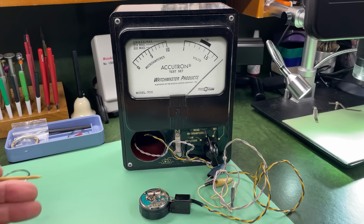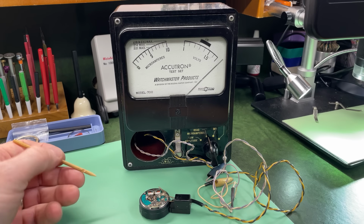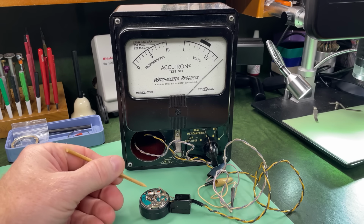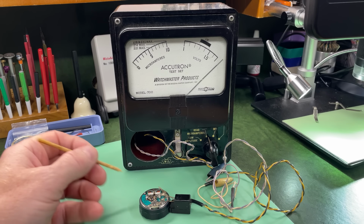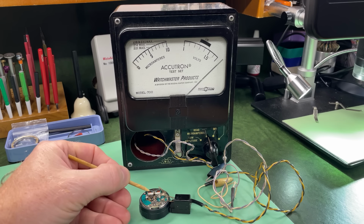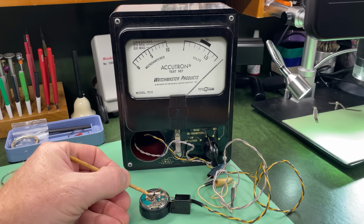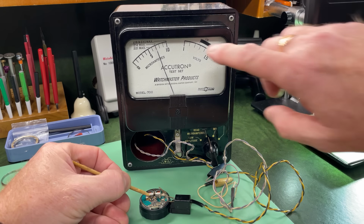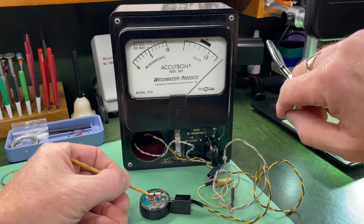So a bit further on now, I've adjusted the fingers and finally got it somewhere near. I've had to fit this thing called a hacking pin because obviously this movement hacks. And if I push that in, I'll be a bit careful here because I'm at arm's length. You hopefully can now passively read that scale. Oops, I've just unpressed it.